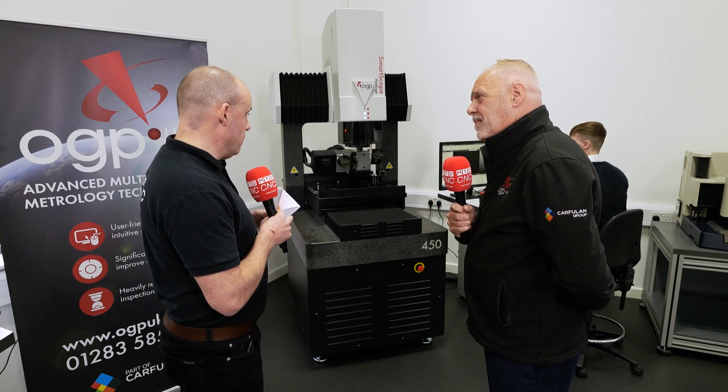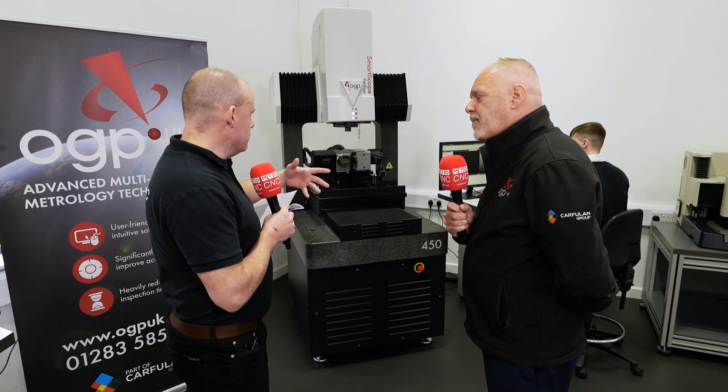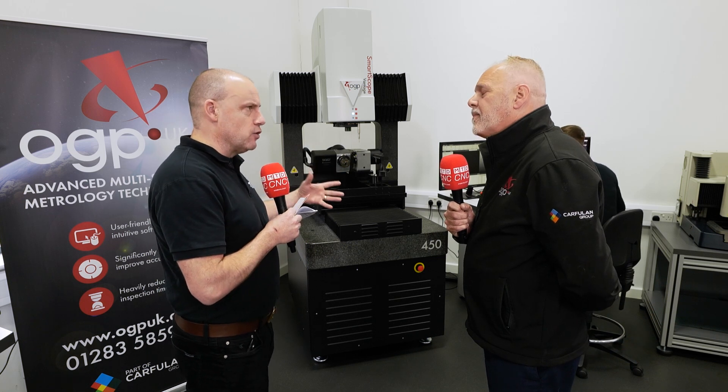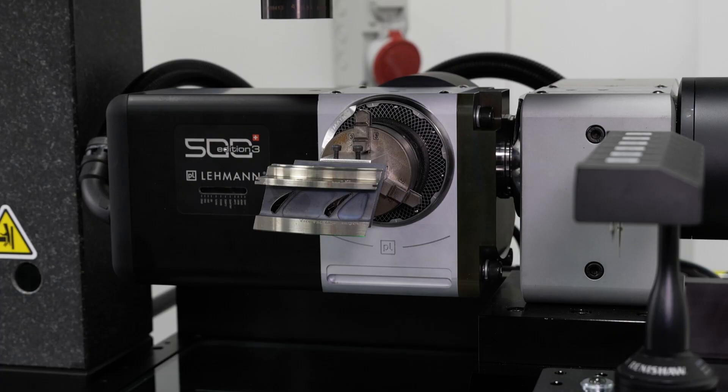I want to learn more about what's going on here — we see a touch probe now being brought into the equation. Walk me through the different areas of the machine. The primary sensor is optics, so all calibration always goes back to the optics of the machine. We can then add tactile measurement — if a company has holes on the side of a part that we can't physically see with the optics, we use tactile measurement. When you say optics, you're talking about a camera-based system — absolutely.